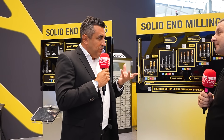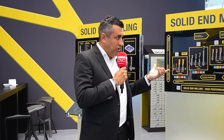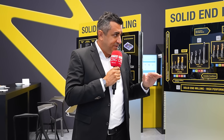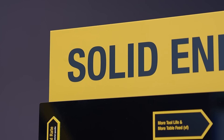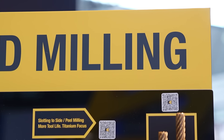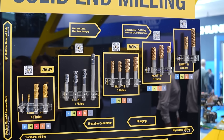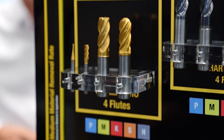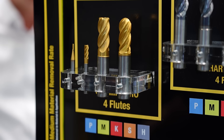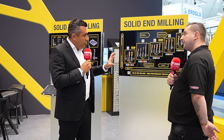The GoMill Pro gives you all the normal features of an end mill, and on top we have a very good coating — the Futura gold coating — which gives you absolutely perfect wear resistance, and you can use it across a broad range of materials. Not every feature is in this end mill; that was not the goal. The goal was to give 80% application coverage, so all the classic applications a job shop has can be covered. If you need something more specific, then you step up to the Harvey 1TE or Harvey 2TE. Now as a customer you can really choose where you want to go with your application.